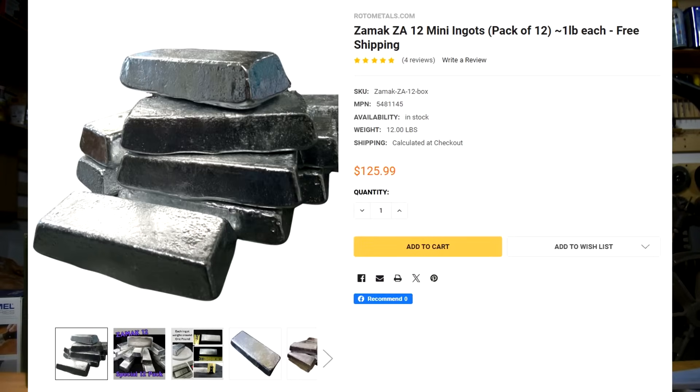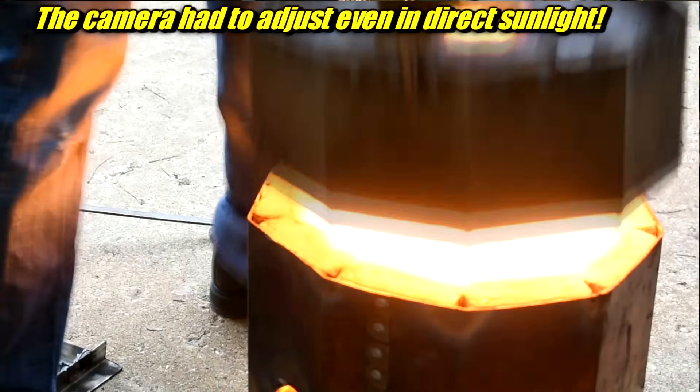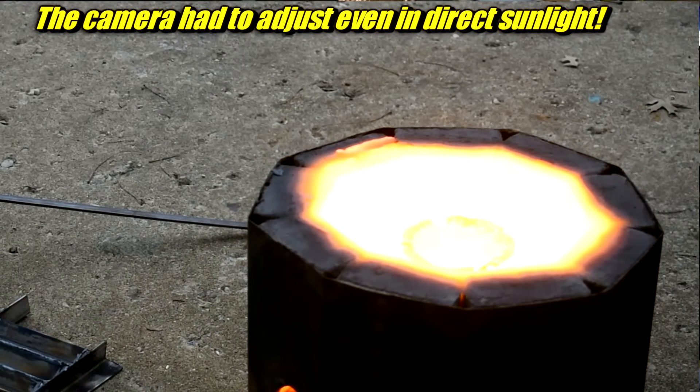First up, the metal is different. I'm using a metal called ZA-12, which is much better than mystery aluminum. Big boy lathes tend to be made out of cast iron. That's because cast iron is really heavy, dense, and it dampens vibrations, both of which you want for a tool that's forcing a cutting edge into spinning steel. Aluminum is neither of those things. ZA-12 is kind of those things. It's no cast iron, but the last time I poured a crucible full of cast iron, I felt like my soul was getting sunburned.